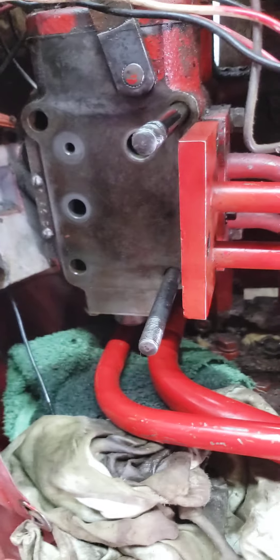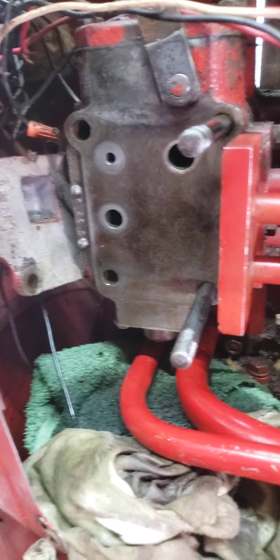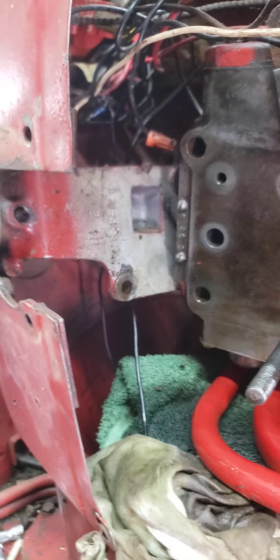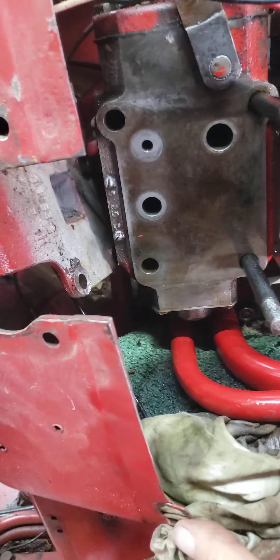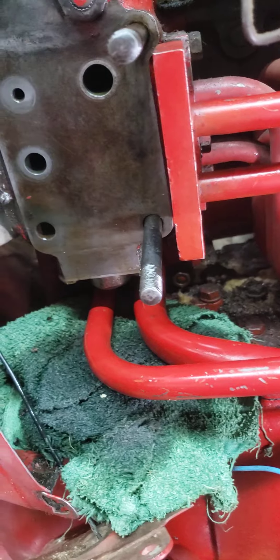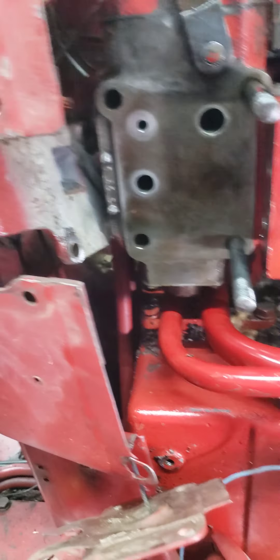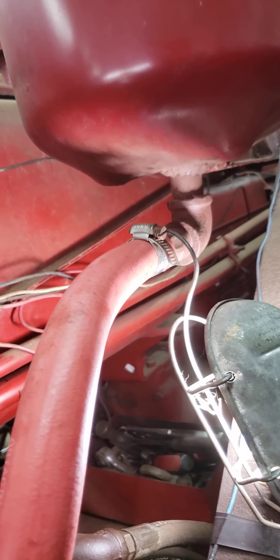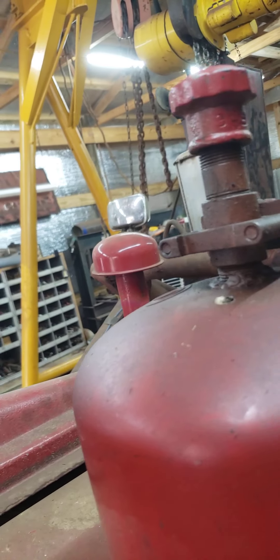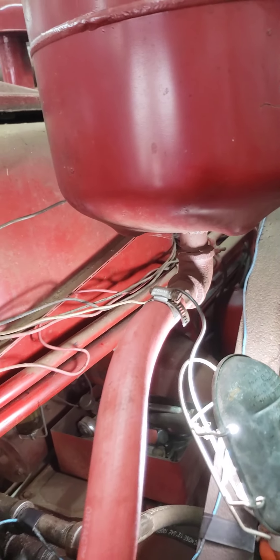I want to go over a few things here — if you've never been into this it can be kind of a challenge. I've already gotten started and it dawned on me I need to be making a video on this. I've done this before several years ago, and it's primarily what causes the leaks in these things — there's a million o-rings in this joker. This tractor has a loader on it, and I added an oil reservoir several years ago — a freon refrigerant tank that I welded a stud into the bottom of and mounted. I needed more oil capacity for all these big cylinders, so necessity being the mother of invention I came up with this getup.